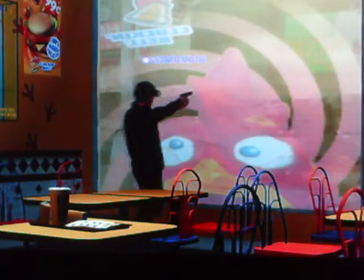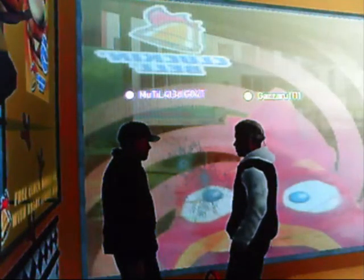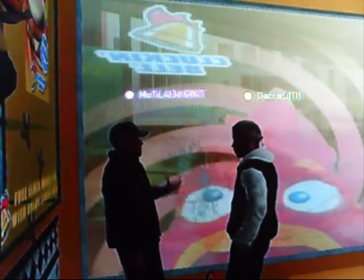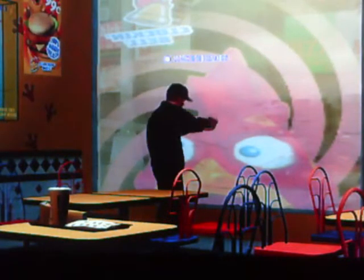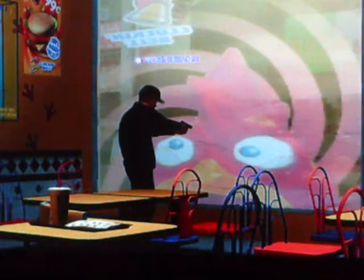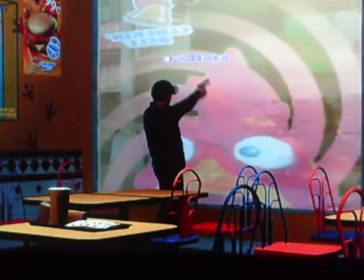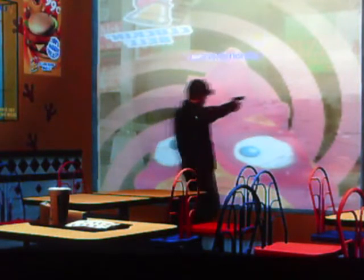Now, guess what I'm going to do? Not the bottom half of the window. Hey, you'll be a great doctor. First, you wash the bottom half, and then you rinse it thoroughly. Now watch closely, because I may ask questions. You have my full undivided attention. You make a pass down the left edge. Then you wipe the squeegee and start across, just like before. And you go across all the way to the bottom and do the edge again. I work my way down, wiping the squeegee off each time, until I get to the bottom. Then I finish off by doing the right edge.